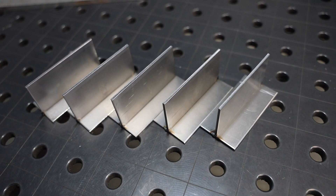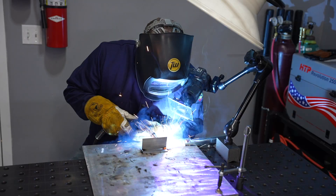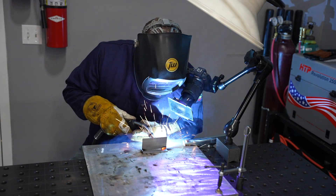I'm tacking together some material to form T-joints to demonstrate these processes. The first process is the most common for general fabrication — it's called short-circuit gas metal arc welding. With short-circuit MIG, often called short arc, the wire feeds out of the gun, contacts your work, then burns back, then arcs out and contacts it again. You don't have a continuous arc, which is why you hear that frying bacon sound. Most MIG welders set up to use shielding gas are going to run short-circuit MIG.